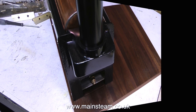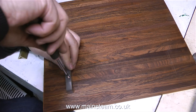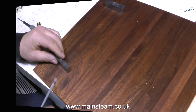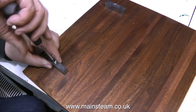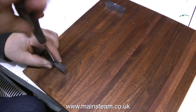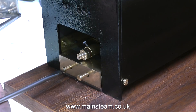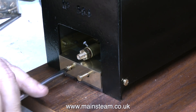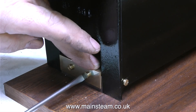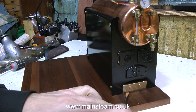Time for a test fit of the blocks. The blocks will need painting, but I have to fit them first to make sure that they fit. In this clip I'm scribing a couple of scratch marks on the baseboard to show me where the blocks are going to fit once I take the boiler off. But don't do it the way I did it first of all — I made a mistake. I scribed the lines and then drilled a hole on each of the lines, and that was in the wrong place. All I had to do was drill a hole slightly inboard of the original line, and the block covers the original hole. These steam plants are all prototypes, so there are bound to be things that go wrong periodically. But this is okay — it's all going together quite well. I've polished up the pieces of brass so they look as though they're designed to be there, and the effect is quite pleasing. I will be painting the steel blocks, but I won't do that yet — I need to assemble the plant.